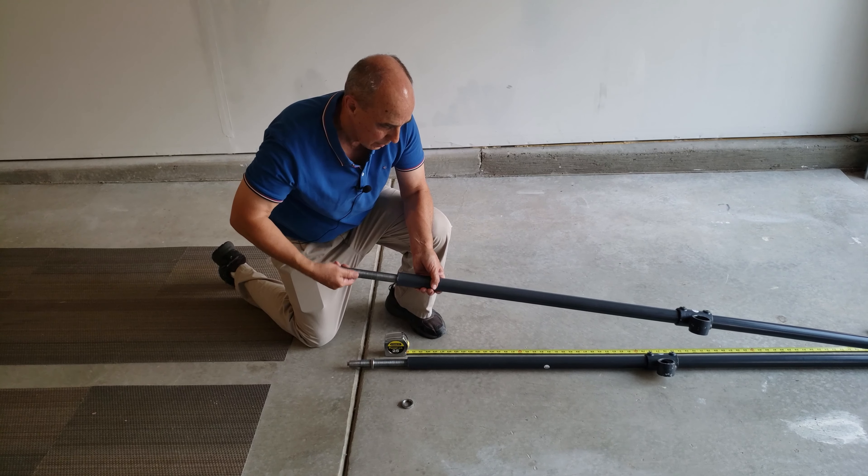Now we grab the vertical pole and start setting it up. It's close to 109 inches, so it's less than 112 — which is what we need to get to. Remember, this is heavy — it's all steel. You can see the top hole — it's going to go right up onto the top plate stem. The beauty is you don't need anyone to help you. I get up on the ladder, raise the pole up to reach the hole, stick the bolt through, and once you do that it starts to plumb itself — it's straight up and down.